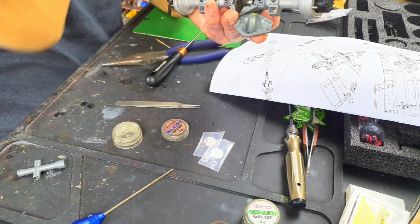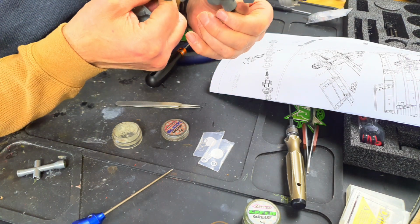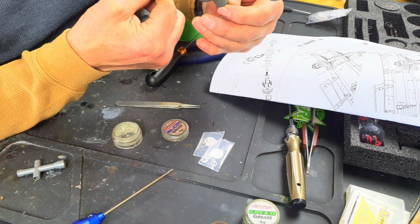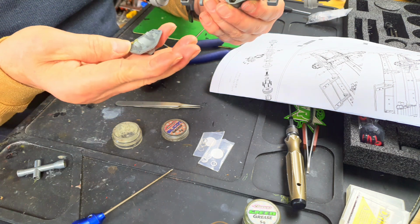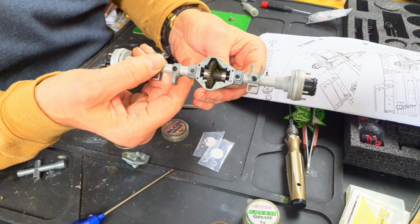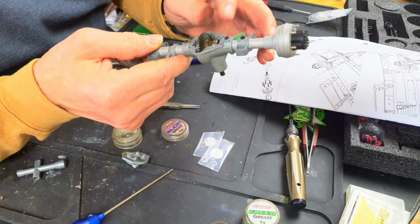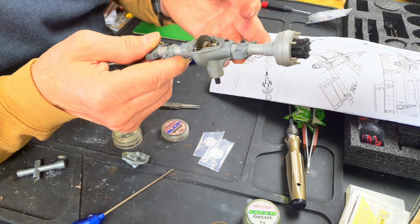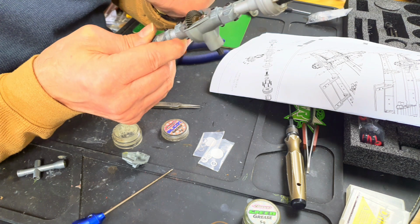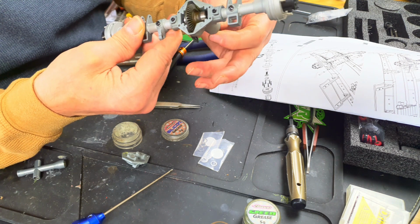Okay, so as if by comparison, this is the middle axle. I noticed, I have shimmed it, but I noticed there was a little bit of a tight spot in it. So I've opened it up to have a little look. And just by comparison, you remember the front axle was all lovely red grease. This has got very little grease in it. It has got something in it, a little bit of yellow, but it's quite dry, almost waxy. Without the cover on, there's no tight spot.